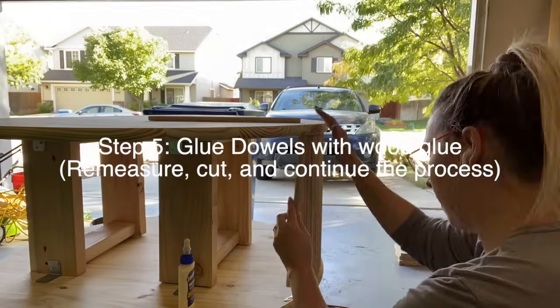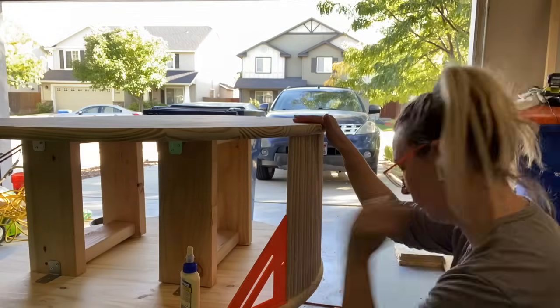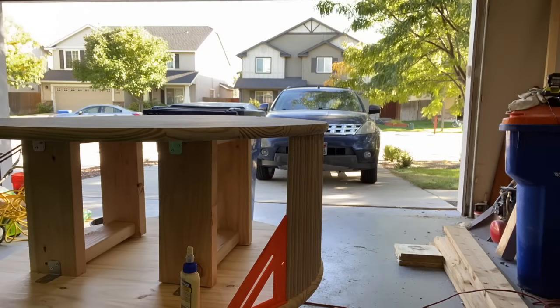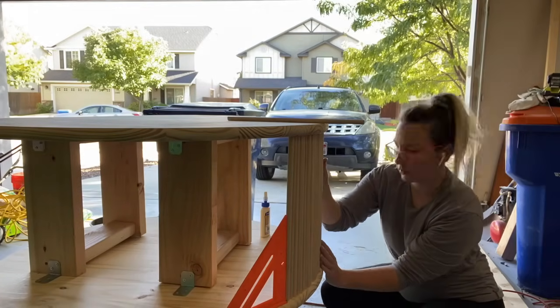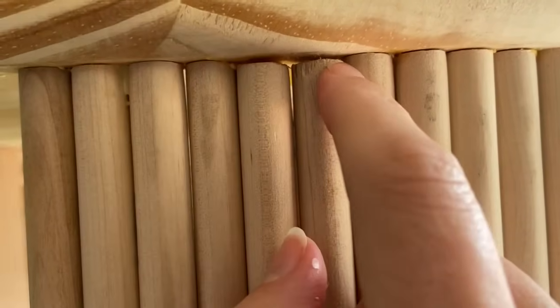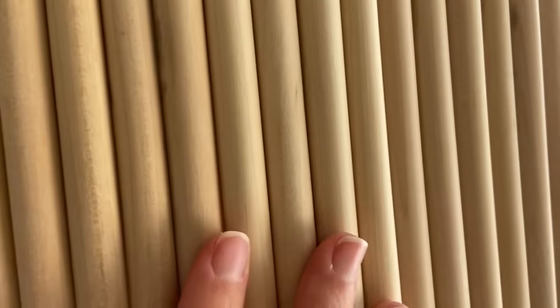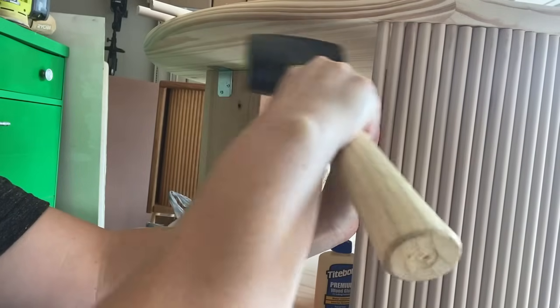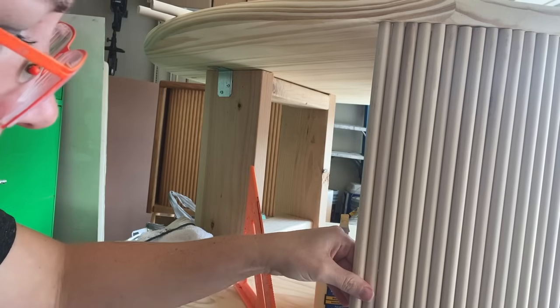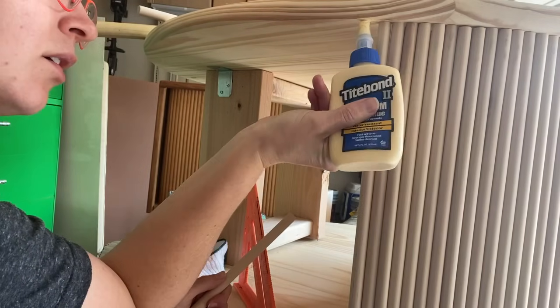This was my least favorite step because it was so redundant, repetitive, and time consuming. You have to attach those wooden dowels with wood glue — I used Titebond wood glue and it worked out really well. Occasionally check with a carpenter square to make sure everything is at a 90 degree angle. Do a little bit at a time and be patient. As you go along, sometimes pieces won't fit — maybe cut a little too short or too tall — so you'll always be making adjustments. A pro tip: very lightly tap the dowel into place to make it more secure, but be careful not to knock others out of place.